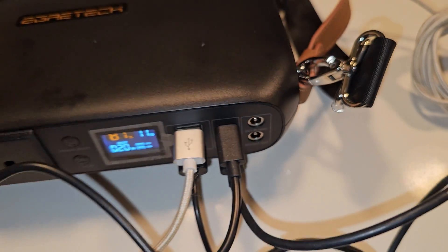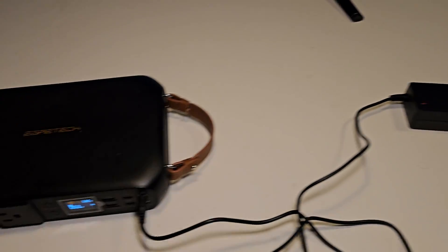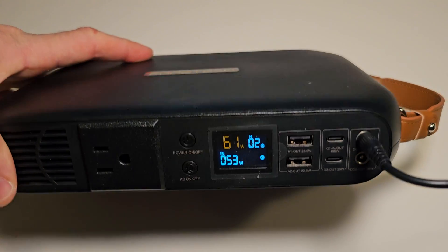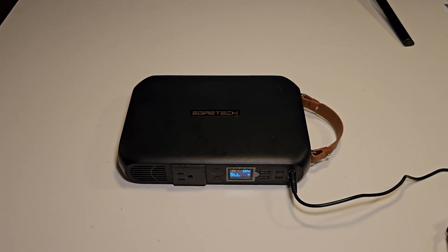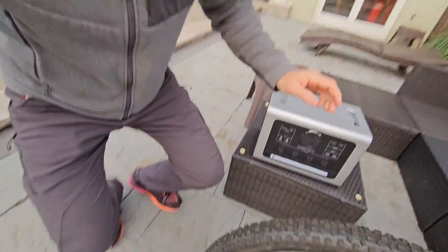There are still 2 DC ports available to plug in your cameras. When you're traveling on a train or bus you can just charge, and when you're out just point and shoot. The charger is very compact at 64 watts, perfect for traveling. It charges at 53 watts, so it'll take about five and a half hours to fully charge the unit. With a 100 watt solar panel, it would take about three to four hours depending on sun intensity. The price is 999, with a discount code in the description box you get 900 — saving 100 bucks on a 2200 watt unit.